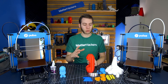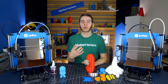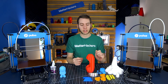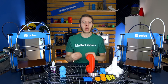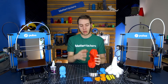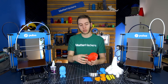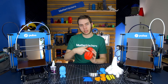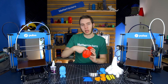With Big Little Designs, we put together this rocket ship that's a couple different pieces to help test the tolerances that your printer is capable of. Some of the wings that fit together, or the little fins that go on here, fit together differently depending on how well your machine is calibrated. There are also other stress testing features, like being able to print this — you have to make sure that your printer isn't going to wobble and knock this over, or you'll see Z-banding. This is also a really good test for your layer cooling, because this can tend to droop since it's just such a fine point at this curve.